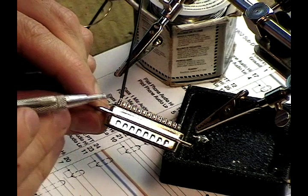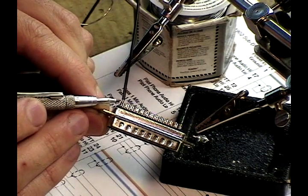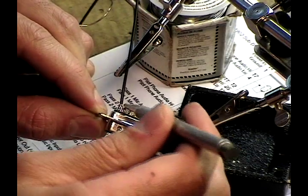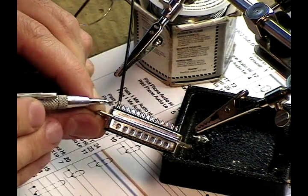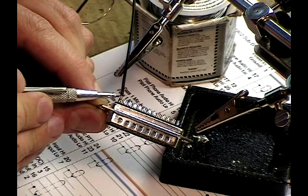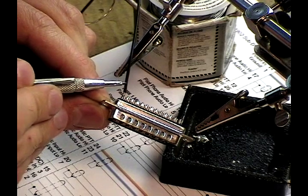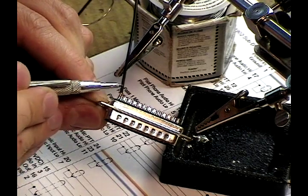Notice the length of the wire strip. It's just enough that the insulation doesn't bottom out against the solder cup, so I know I got full insertion of the wire — and yet it's not so much that there's an inappropriate amount of bare wire extending.